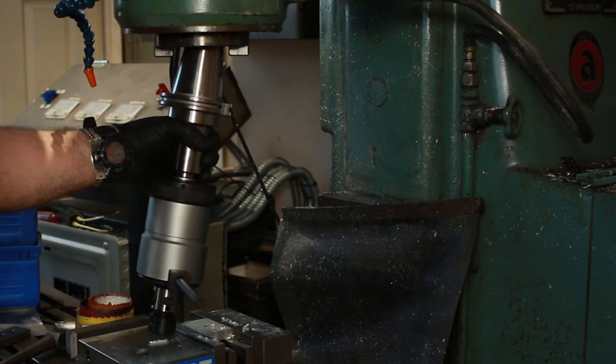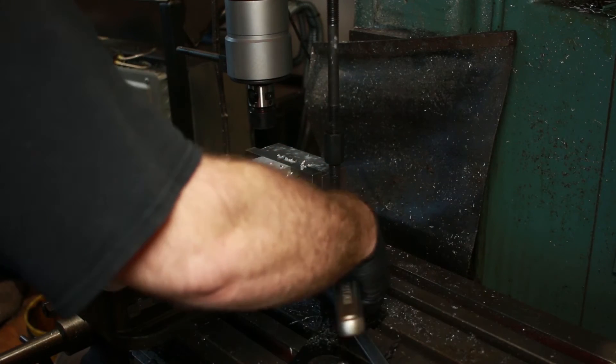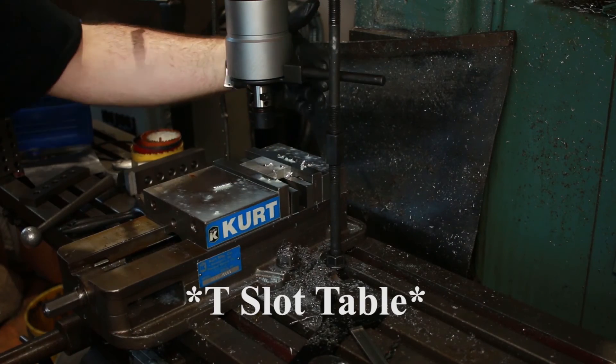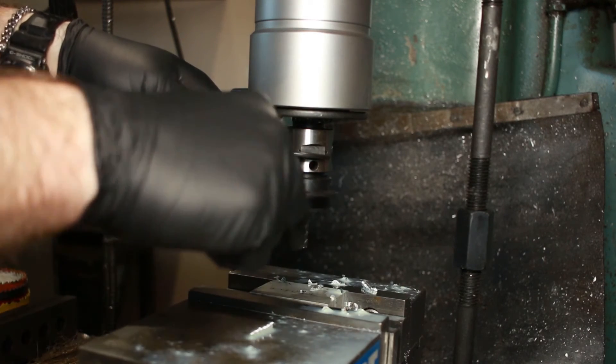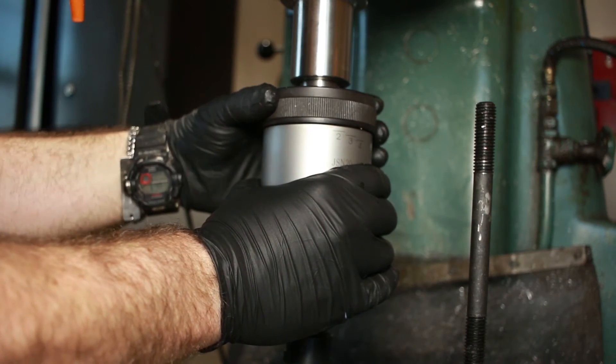After drilling your holes, you simply insert the tapping head into your machine. Rest this bar on something solid and within reach — I am using two rods threaded together clamped to my T-table. Then insert the tap; push the tap up until you can see it in the hole, then tighten the collet nut. Now you set your clutch. To what? I don't know — I just guessed light. There are marks, but they kind of stink. If it slips too much, you need to tighten it. If your tap breaks, then you need a new tap and you need to loosen the ring.